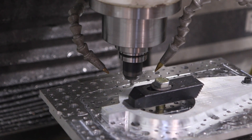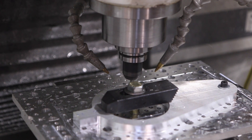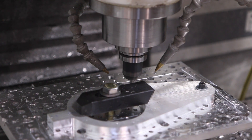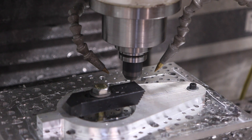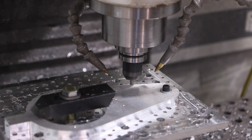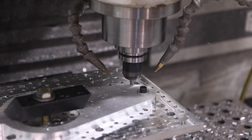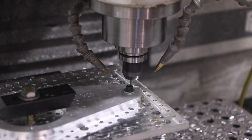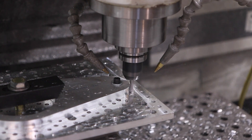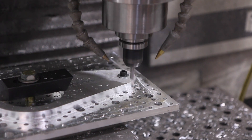One of the things I wanted to mention when we were on the DeWalt: it is so important as a job shop to be able to get your raw material made into the workpiece size you need quickly and efficiently. I think people underestimate that — they think about the machine time or the programming time and the CAM, and they don't think about the fact that maybe you can't afford to order 12 or 20 feet of a certain extrusion size just for a smaller job. So you've got to take material on hand, whether it's plasma cutting, DeWalt multi-saw, band saw — you've got to be able to get raw material ready to make money.